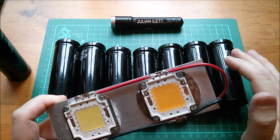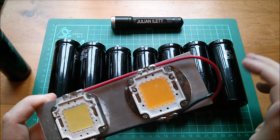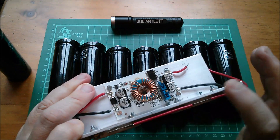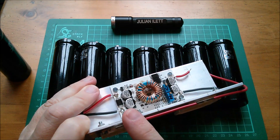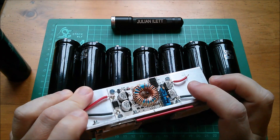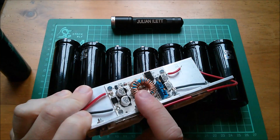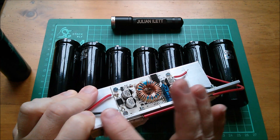The issue is that as the 100-watt LED consumes energy from the supercapacitors, that initial voltage of 20 volts will fall to a point where the boost converter isn't going to be happy with the input current. We've got a continuous sustained 100 watts on the output — fixed current and fixed voltage. The boost converter is boosting that initial 20 volts up to about 34 volts for these 100-watt LEDs, but as the voltage falls, there'll be fewer volts and more current on the input.